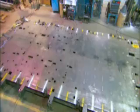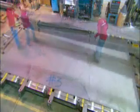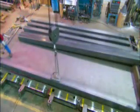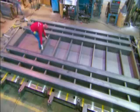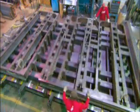The truck scale structure in which they'll install the load cells is called the weighbridge. They begin assembling it upside down with a surface made of steel plates. To build the base of the weighbridge, they lay out a grid of thick steel tubes and crossbeams. Workers lower a guide to help them align the parts perfectly.